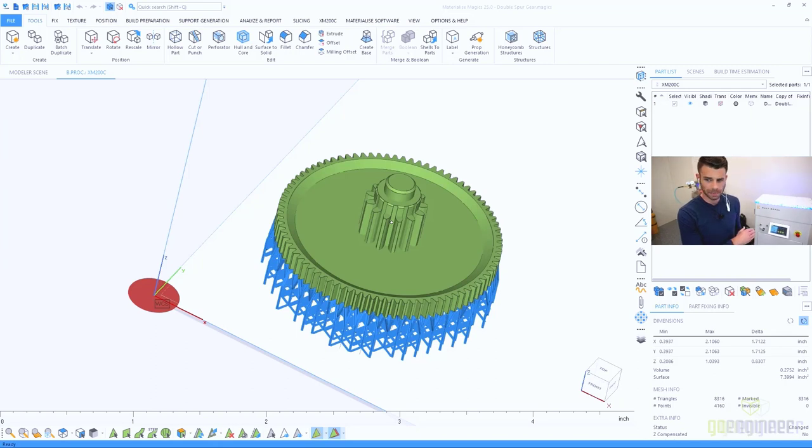We come over to the machine, level the bed, make sure we have enough powder, and start the purge. We need to evacuate all the oxygen out of the machine. The purge takes various amounts of time — figure about 20 minutes, maybe a little longer, depending on how long it's been since you've used the machine. Once the machine is purged — we know because we have an oxygen reading on the UI — right now it's at 18%. When printing, we want it at less than 0.3%. So we start the auto purge, and once it hits 0.3% it allows us to print.